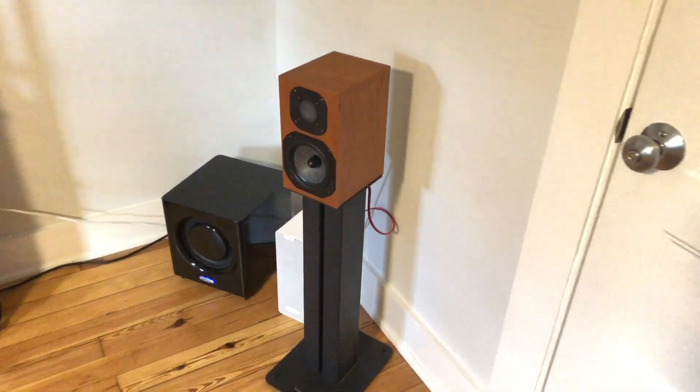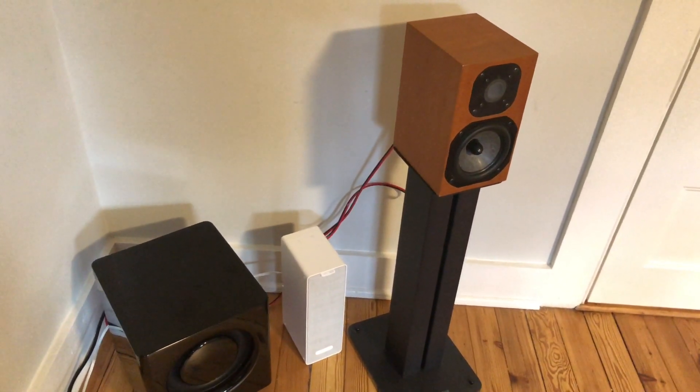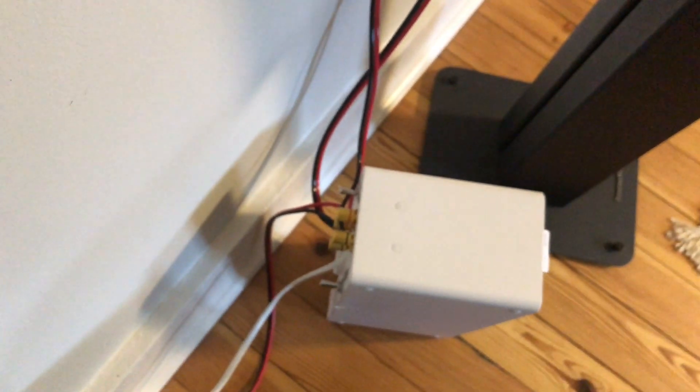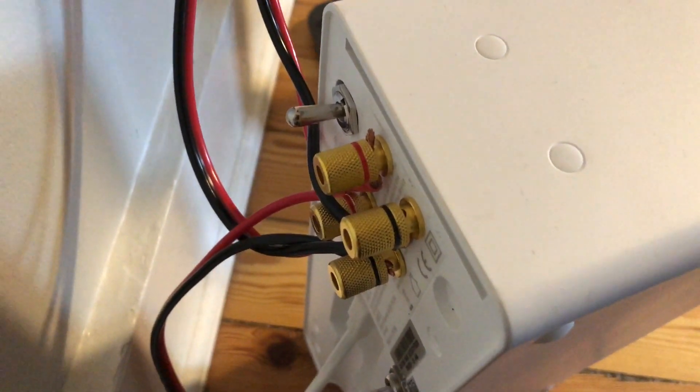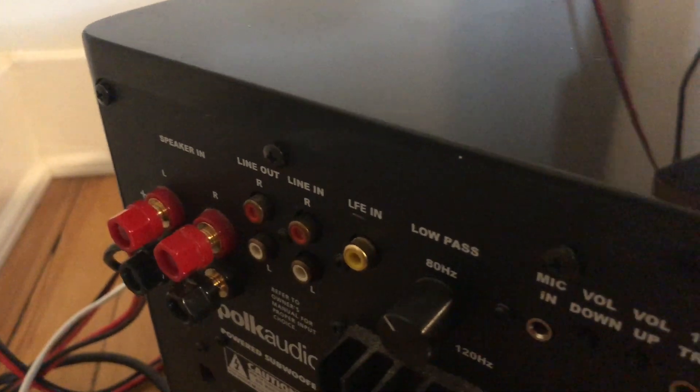Over here I have a second speaker and a second Symphonic powering it. I also have my powered subwoofer, so I'm combining the technique from my previous video. In addition to hooking up the Symphonic woofer output into the speaker, I'm also jumping a second wire off the woofer and bringing it over to the powered sub. You can see the second wire here where I'm jumping off to provide a signal to the subwoofer, which is now plugged in as an input for the subwoofer — that's how we're getting a signal in there.